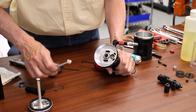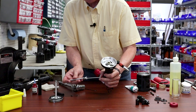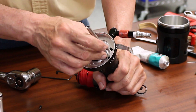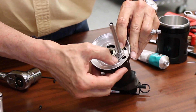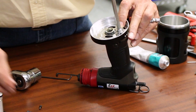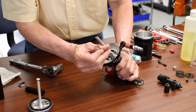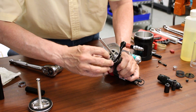The next thing we want to do is install the air valve, which is in about three pieces: the inner valve, the outer tube, and the retaining plate. We'll install that. These ears, if you can see them, are notched — they need to make sure there's clearance on the exhaust. We'll take our screws and get those started, then take our Allen wrench and run those down just so they're snug. Then we'll do a final tightening.